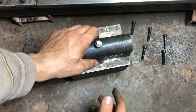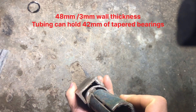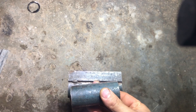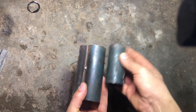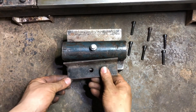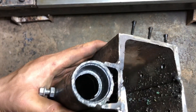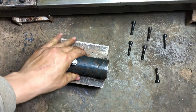For the spindle housing I made it from 48 mm tubing that accepts exactly 42 mm outer diameter tapered bearings. I made the spindle using this technique: I cut a small slot from the tube and put it inside the other tube, then made an M8 bolt in the middle to hold everything together. Normally everything should be bolted on, using a corner bolted to the headstock and through the tube. But for now I just made small spot welds so I can test everything — I have no patience.